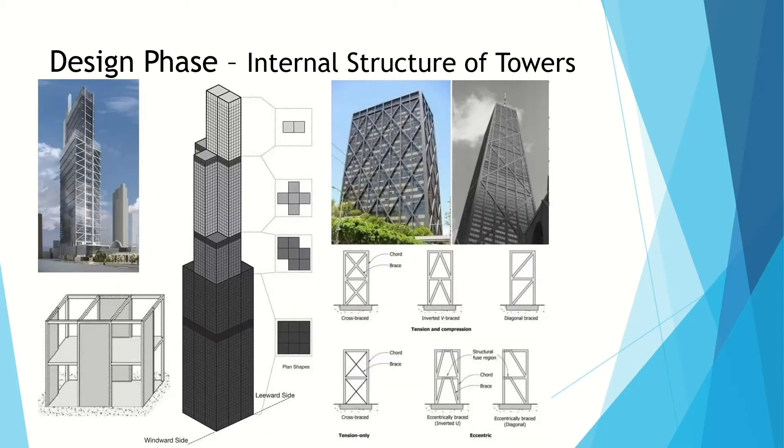The design phase is really going to test you on how you think about the structure of the building. This is just a basic structure of a building — you'll see in the pictures that they use a lot of cross members. There's a lot of bracings used, and this is to prevent twisting, compression, and tension. I just want to point out that you really want to look into adding some cross bracings, because when you just add structure going straight up, it's going to be subjected to twisting and make the build a whole lot harder.